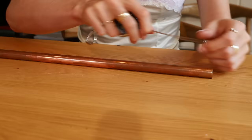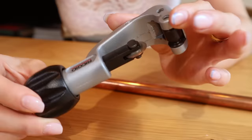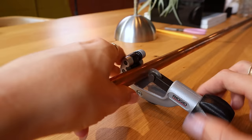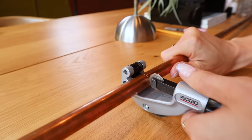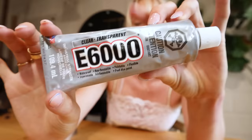Just under ten inches — I want to leave about an inch of threaded rod at the top, so I'm cutting the copper down to about nine inches using a pipe cutter. To use a pipe cutter, tighten the blade to your pipe, then alternate between twisting the pipe and tightening the blade until it snaps off clean. The idea is that the copper pipe will take the weight of the glass top, rather than having anything rely on the threaded rod.